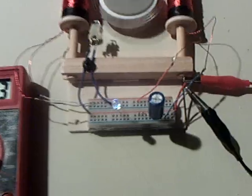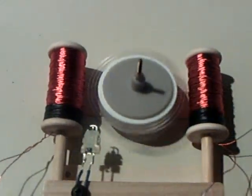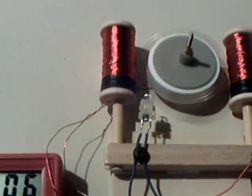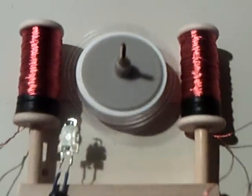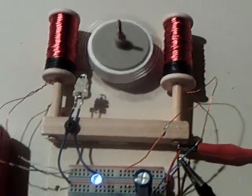As the saying goes, timing is everything. Thanks to Tin Man, Patrick, and John's picture that Patrick took of where the timing was on this zero force motor, I was able to get my little motor to run much, much better at a much better amp draw. I'm down in the low milliamps now, which is where I wanted to be with this.